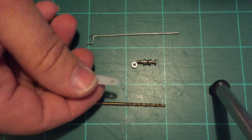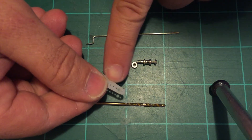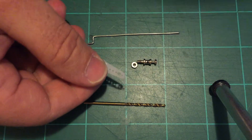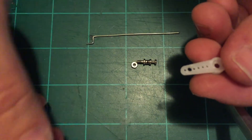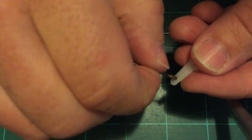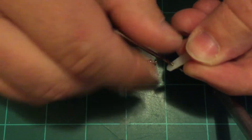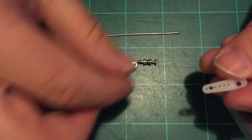When you get your servo arm, the only thing you're going to have is these little small holes right here. First thing you're going to need to do is find a small drill bit and drill that out. You can actually grab it and spin it through that horn well enough to where it'll get large enough for your easy adjuster to fit through there.